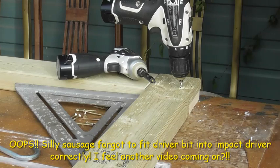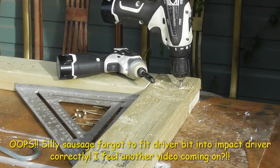And in this case, I've pre-drilled 4 holes with a 2-3mm drill, and I'm now going to put in the 40mm by number 4 screws. I think these are 45s, but hopefully they shouldn't protrude, as long as I don't push the heads in too far.